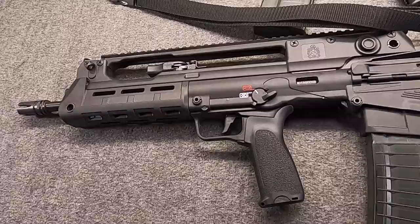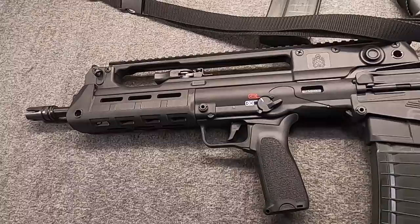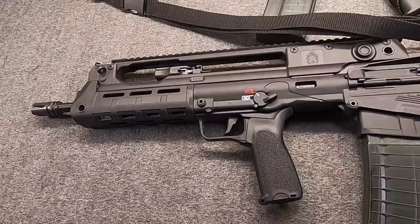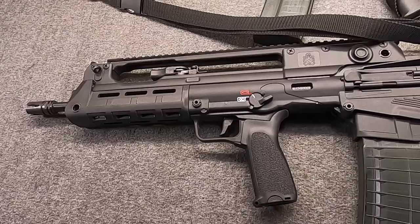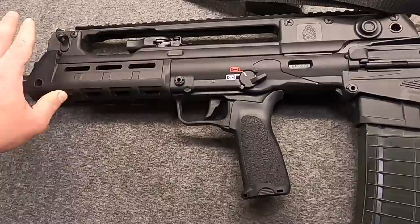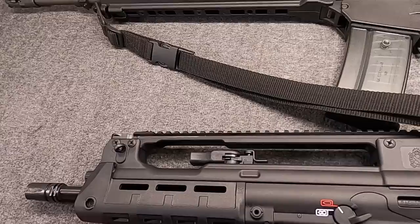Then they turned their gaze to the French FAMAS, which is why the original VHSs look a lot like one — including even having the lever-delayed blowback system. They were always chambering these for 5.56, but there were multiple prototypes in 1996, 1999, 2003, and 2004. Even when they first showed off what would become the VHS to the defense minister in 2005, it was far from done. A design starting in 2003 implemented a short-stroke gas piston, not unlike what they found in the G36 or HK416, and that's the one that really ended up being a success.